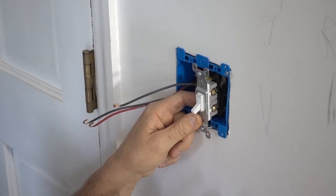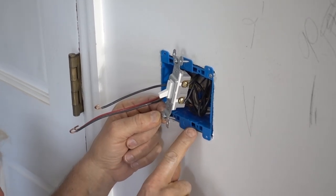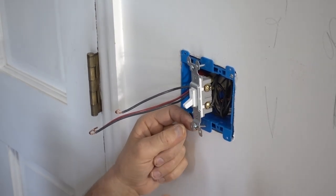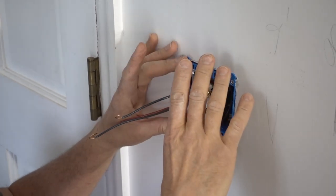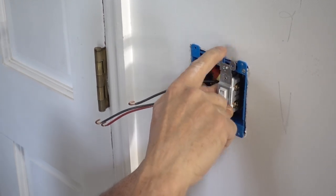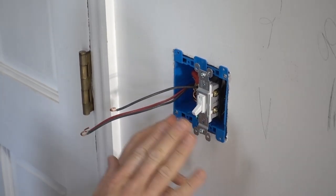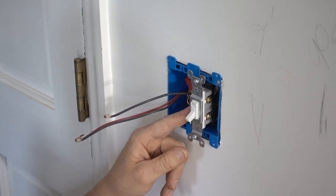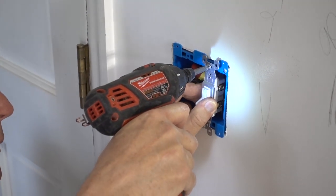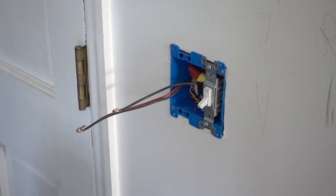A lot of switch covers — you need to pull these tabs off and the switch will go between where this tab is and the wall. This part right here breaks off. The type of covers we use are a mid-size cover — they have a little space and the tab is actually able to stay on, which gives you a little more strength against the wall, more metal touching the wall besides just the plastic. So if you're pushing on it, it doesn't flex. It's not a big deal on switches, but when you come to receptacles, that makes a big difference.